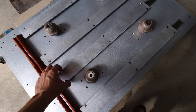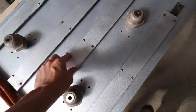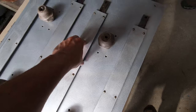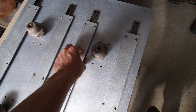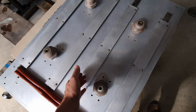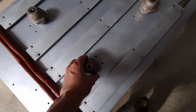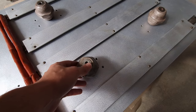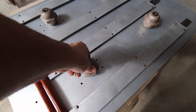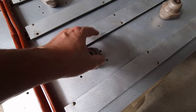So we got our resistors in underneath these aluminium plates over here, because you have to apply pressure to the resistor, or else when it heats up it will just open up. Okay, so you always have to put something compressing the resistor. So our resistors are here. We've got the cables, we got our mica insulators that will withstand, like, I think that's 800 degrees Celsius, almost 1000 degrees Celsius. These insulators, amazing.